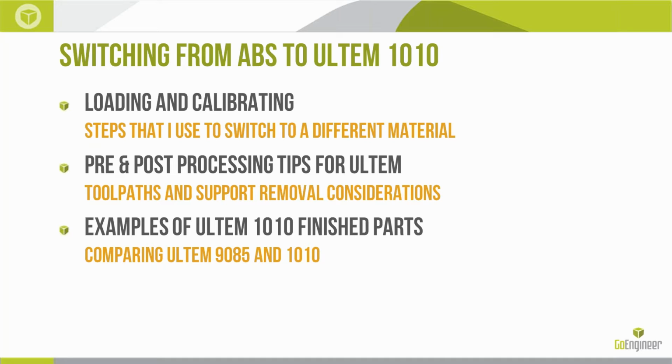The parts that I've been printing have about a 6-inch hole up through the bottom with a rounded top. There's support material up in there. It's about a 3/8 of an inch hole. So I'm going to have to go in and get a long pick or some sort of small drill bit to get rid of that support material up in there because I can't get at it very easily. I've definitely seen parts that people have tried to print in Ultem where you're never going to be able to get a layer or two out between a sandwich of model material.